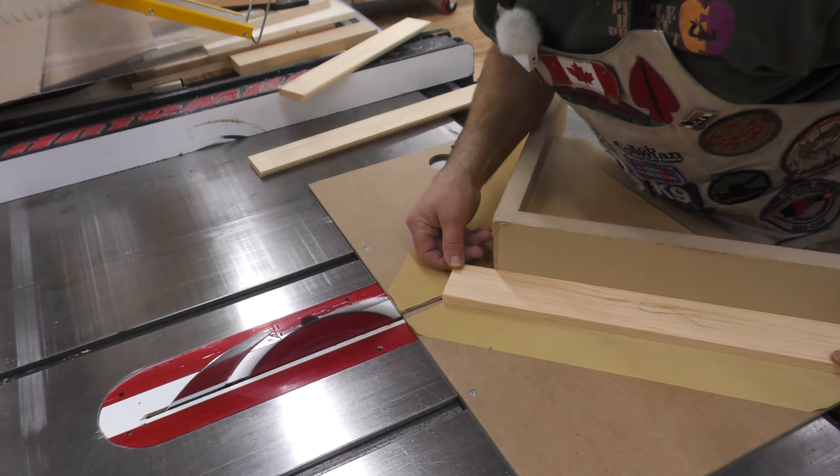That's a mark that came from the thickness planer. I don't know if I can get rid of that or not. Whenever you can't finish your pass, at least lift your plane off while in a forward motion, and then you don't end up with a noticeable mark. If you leave it like that, then you're going to get a bit of a ridge there. But if you lift off in a forward motion, it'll leave it nice and clean.